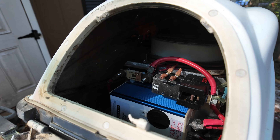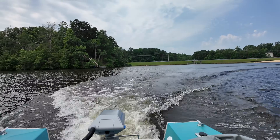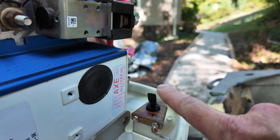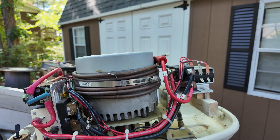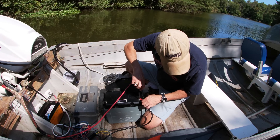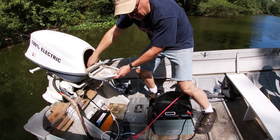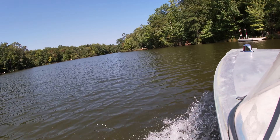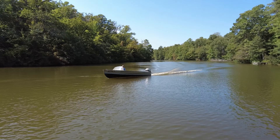Let's take a closer look at the really amazing motor that my friend Dan is testing on the back of his vintage StarCraft. This motor is a 10 kilowatt motor, similar to what is used to run a golf cart. For comparison, the 9.9 horsepower equivalent e-Propulsion Navy that is running here is only a 6 kilowatt motor. As you can see, there are a lot of other components hooked up to make this all work, and there's copper piping running around the motor. These pipes have water pumped through them from the impeller to help cool the motor. We tested it using my 48-volt 100 amp hour Epoch battery just to see how well they would work together. We hit speeds over 10 miles per hour and the boat felt really good, even with the 100-pound battery in back. I even got a chance to get behind the wheel and feel how well this boat pulled.